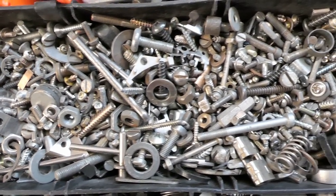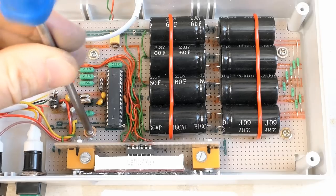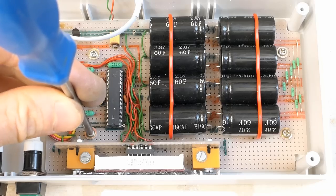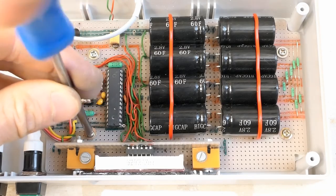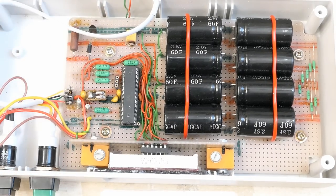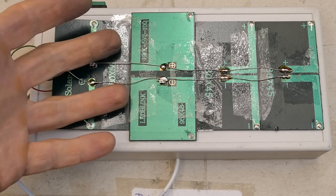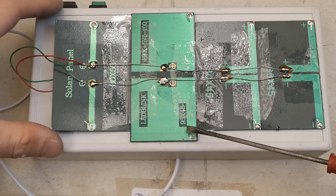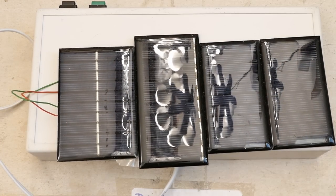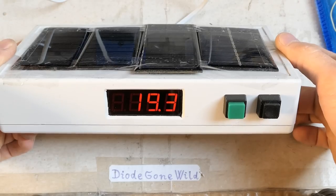Looking for suitable screws to screw the board into the box. The four screws are in — these are self-tapping screws, and when putting it back a second time, insert it carefully, turn counterclockwise until it clicks, then drive it in, instead of shredding the plastic by cutting a new thread in a different position. It's temporarily horribly botched together, but eventually all four panels will be the same type — 95×48 mm, 11 cells in series. I'm still waiting for them; the temporary panels are just sticky-taped on. For the final ones I need a better solution, but most importantly it works.